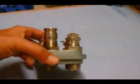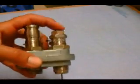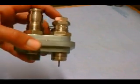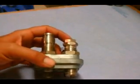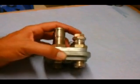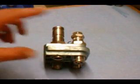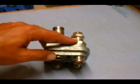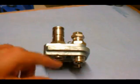So now I want to go into the dies themselves. The first one here is a full-length sizer die. And the reason I went with a full-length sizer die with the Dillon is because, especially for 40 Smith & Wesson, it's notorious for bulging the cases. And I'll do another video on bulging cases and things like that. But this is a full-length sizer die, so it'll take the belling that occurs on the bottom of the casing. It'll take all that out.